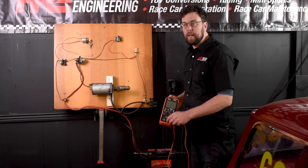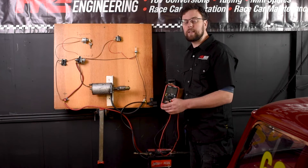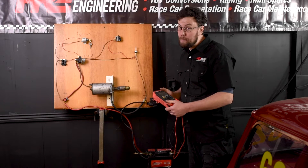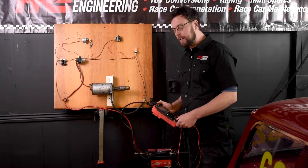What I have here is my multimeter. A multimeter is a really useful tool for fault finding electrical connections. How good is it at testing batteries? It can give us some indications as to the battery's health, but that's about all it can do. The high rate discharge tester is really the ultimate way of loading down that battery and seeing what its capacity is.